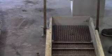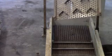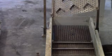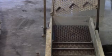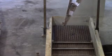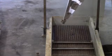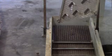And underneath this punch plate, as you can see, these are what I call chevrons, and they're a 3/4 inch piece of flat bar that I've bent and mounted on the punch plate. So when your material hits in the back, it comes in under, hits this first chevron, and it splits the material two times, and it splits it three times here. The whole idea is to slow down the material. As you slow down the material, the gold drops out.